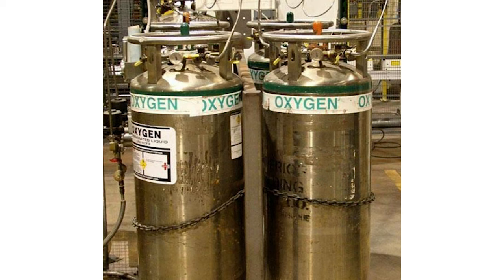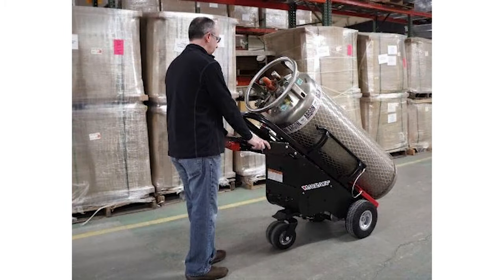Another product to look at is cryogenic — refrigerated liquid cylinders — which come in oxygen, nitrogen, argon, and helium used for charging magnets in the MRI industry. They are large containers with specific cylinder carts used to carefully and properly move them. Then there are pyrophorics, also found in the computer chip industry. A pyrophoric is a product that reacts with air — instantly creating a flammability situation when released. An example is silane. That's pretty much an overview of the things to be considered in a general perspective.